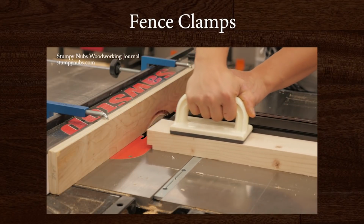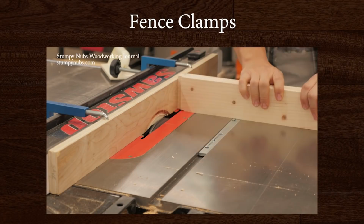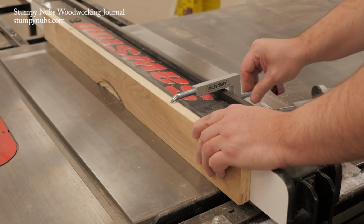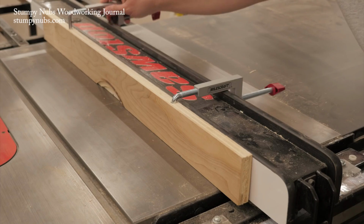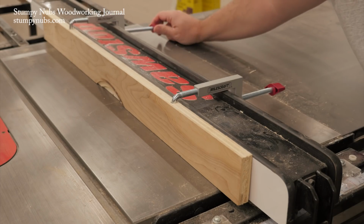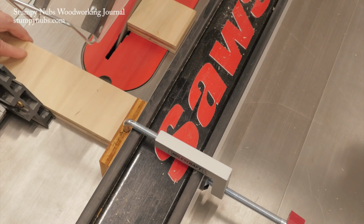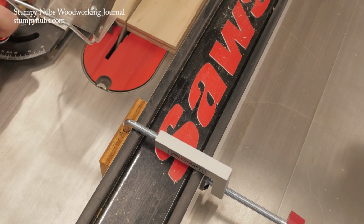I use sacrificial fence faces frequently when cutting rabbets, tenons, raised panels. You've seen them in lots of tutorials on our channel. And these handy little clamps are by far the handiest way to attach a fence to a fence. I've used different brands, but the Milescraft version seemed to be the best balance between quality and price. They're universal, meaning they will work with wide fences and narrow ones.